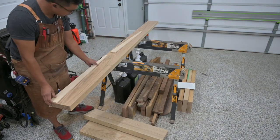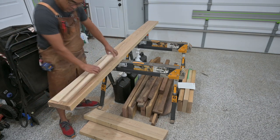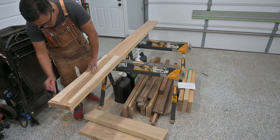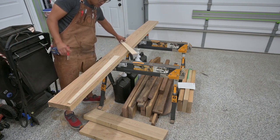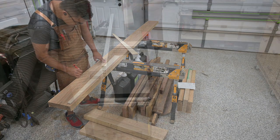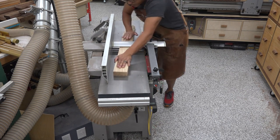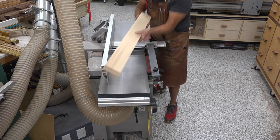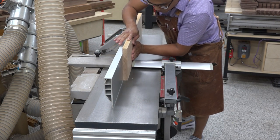Here's a great example of why I like to use templates versus just cutting out parts on the CNC. By laying out the legs with templates, I'm able to see what the grain pattern will look like once I cut out the parts. In this case, I was looking for the straightest grain possible to run the full length of the leg. Once I have the parts roughly laid out, I go through the milling process by flattening the faces of each of the parts and then planing them down to final thickness. For whatever reason, I just forgot to hit the record button while I was planing.